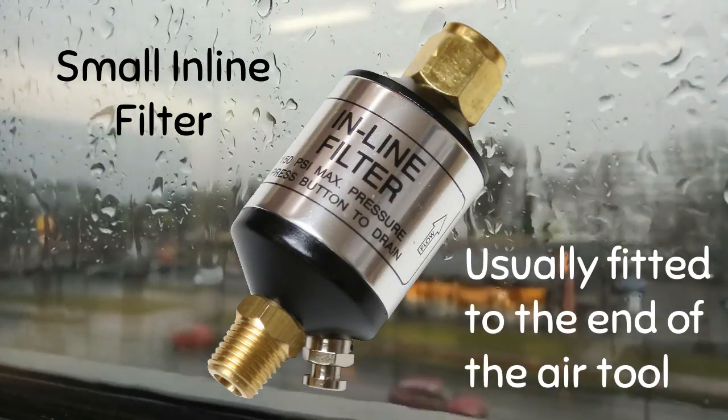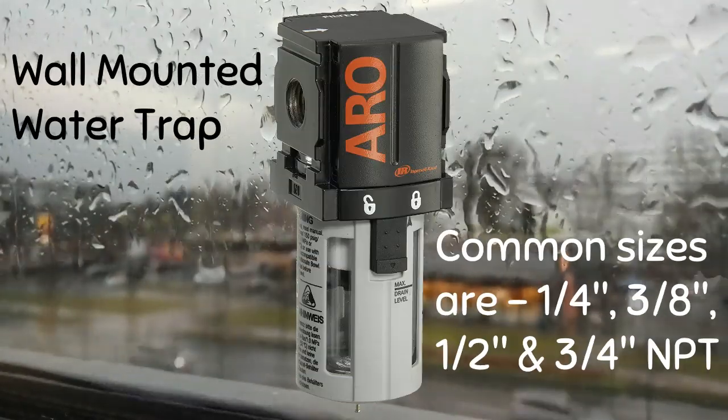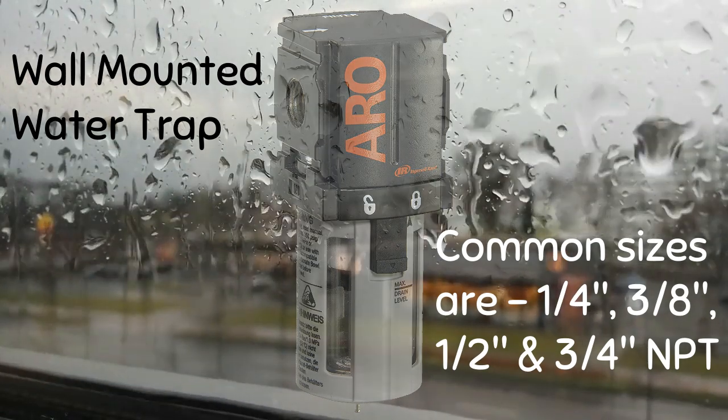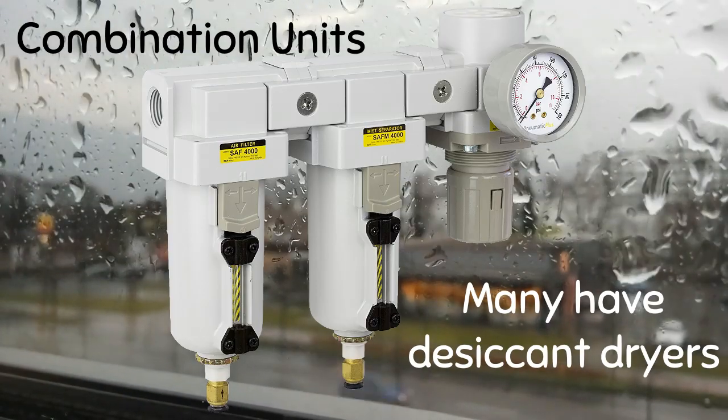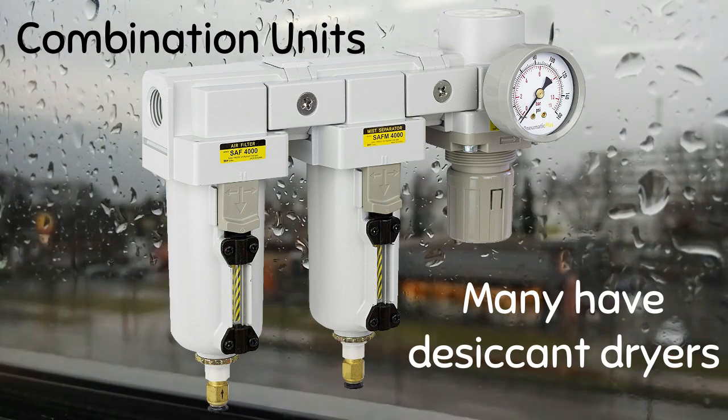Small inline filters are usually fitted to the end of the air tool. Single wall-mounted water traps come in a variety of pipe sizes ranging from 1/4 to 3/4 inch NPT. Combination units come in a variety of configurations with oilers, regulators and desiccant dryers.